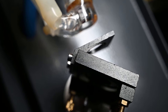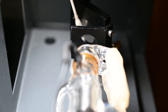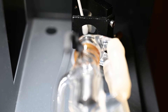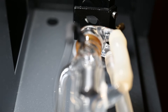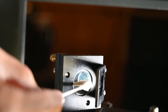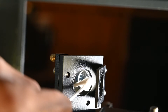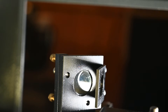You can see there's not a lot of distance between the end of the laser tube and mirror number one housing, so let's clean that next. Fresh Q-tip with alcohol on it, and we're just going to give that a nice little cleaning as well. And that should be good to go. Here we can see mirror number two, and again we're just going to give that a nice little cleaning.